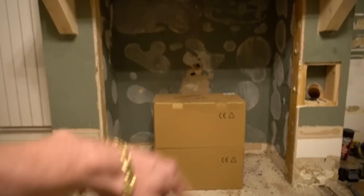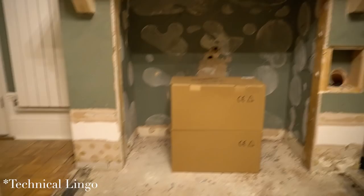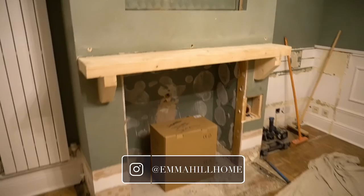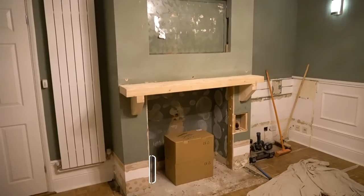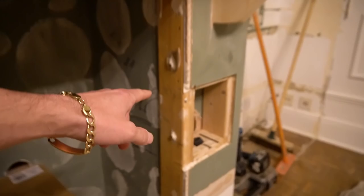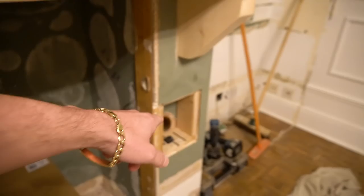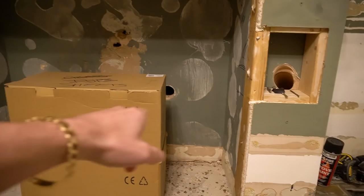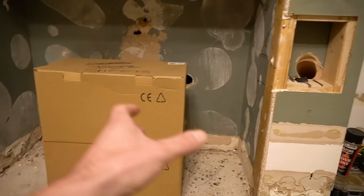That's Monday in the bag. The fireplace people have left. I've made my makeshift stove thingy just to see how it's going to look. The hearth has come fully up — the guys were going to lay the new hearth on top but said it was a bit loose, so they've taken it completely up. The only thing we now can't decide on is whether we should take out this whole front panel, because it's all timber and plasterboard, which is so close to the stove it's not outside the appropriate distance for combustibles to the heat source.